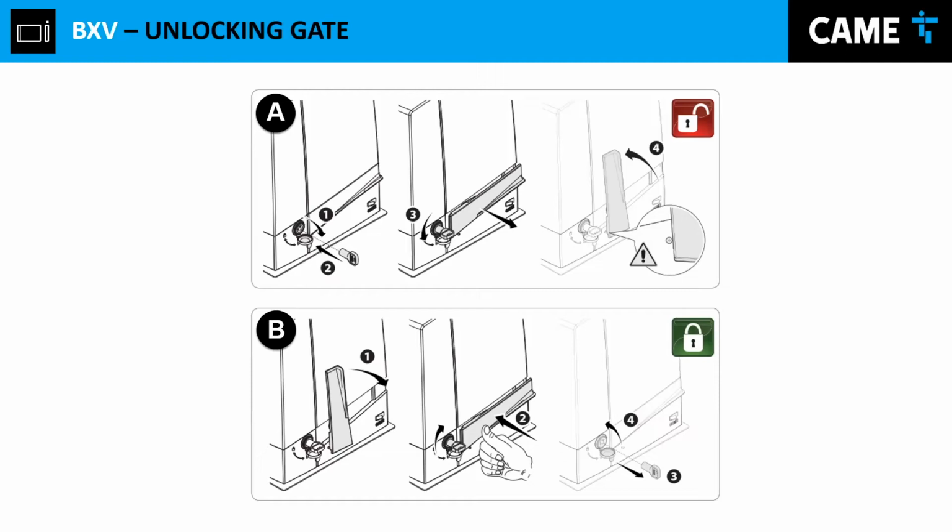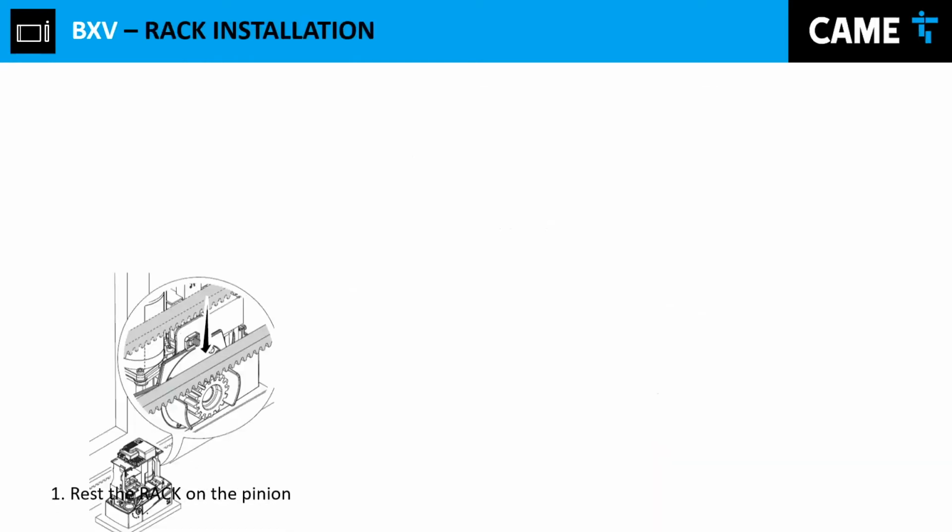So you see in the panel, I don't know if you can appreciate that, but it says E8. That's an error code. That means that the gate is open, that the lid is open. In fact, we have a sensor. Even if I close it here, the error won't go away. So basically you have to unlock it. That way you activate a switch and the error goes away. It's just a safety feature for you, the installer.